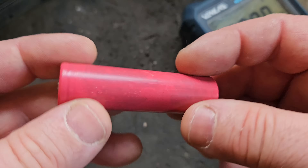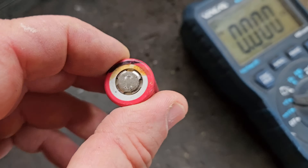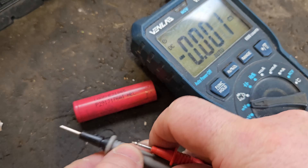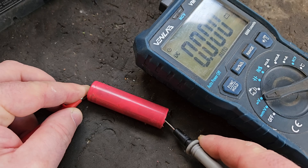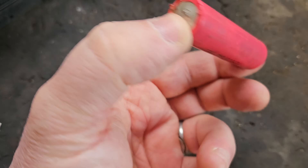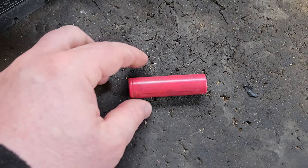But we're going to do it for entertainment and educational purposes here today. If I can get this going, this is going straight in the recycling bin — rest assured. First of all, we're checking the voltage just to show you the condition of this cell. There's no power there — that should read between 2.5 and 4, but it's reading nothing.